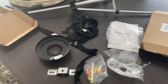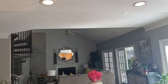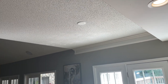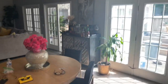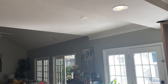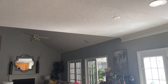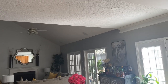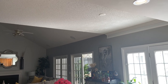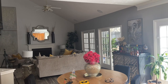The problem is, because it's so heavy, I need to find a location to mount this in the ceiling. I did have a box there that had a light in it, and it came down sort of where the door is — it just didn't make any sense for that light to be there unless it's just a really small table. This is the table that's going in here, so I need to mount that light above the table, but I can't move the box without having to do a lot of ceiling repair. So I am going to mount it, wire it to that box, and then chain it over so it can fall underneath the table.